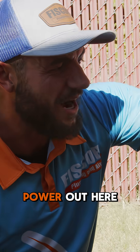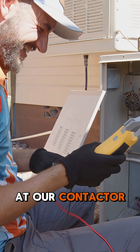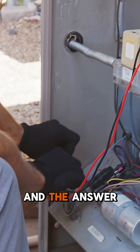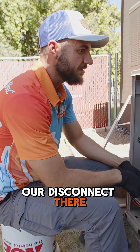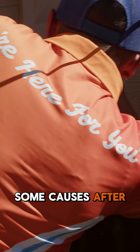Units on inside, obviously we're not getting power out here, so first thing we're going to do is we're just going to check for voltage at our contactor here. We're going to see if we're getting anything, and the answer is no. Probably have a blown set of fuses inside of our disconnect there. We're going to confirm that's the issue, and then we're going to start narrowing down some causes after that.